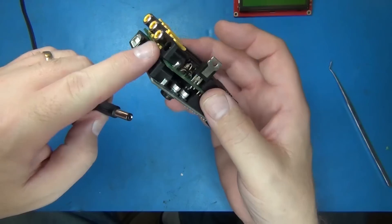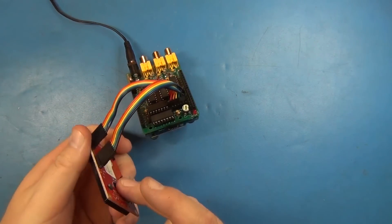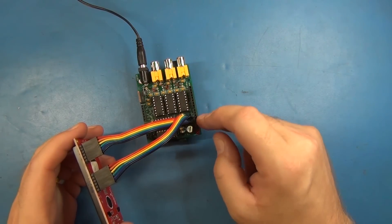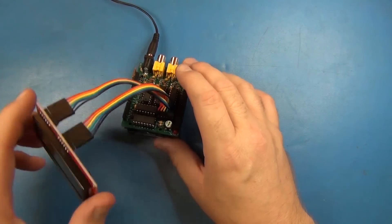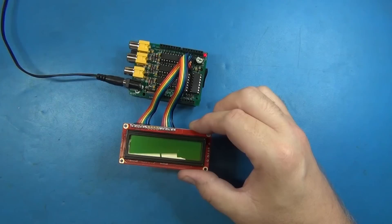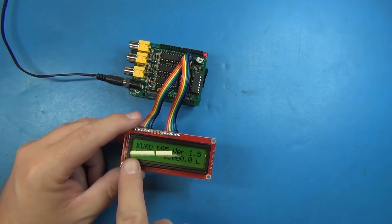I'm going to power from the top board which has the larger 5-volt regulator. The display wires from the SparkFun order connect pins one through six and eleven through sixteen - they're marked, so red up top goes to number one and red on the side goes to eleven. They're short enough to fit in a box nicely. Starting to turn up the power - power light comes on, display comes up around six to seven volts. Taking it all the way up to about fourteen volts, which is about what the radio outputs. It's showing the display but no frequency yet since it's not hooked up to the radio.